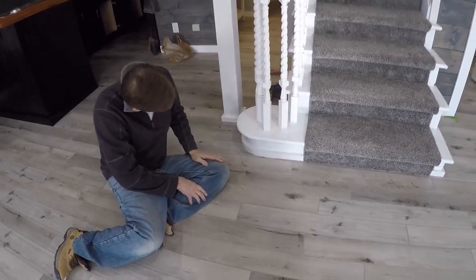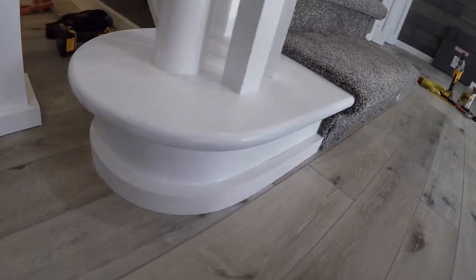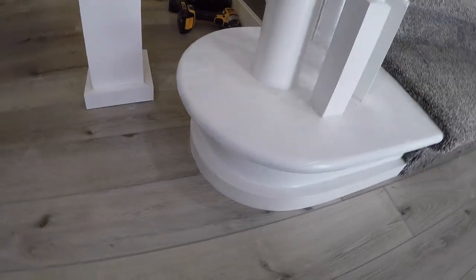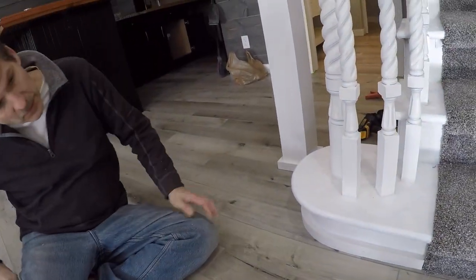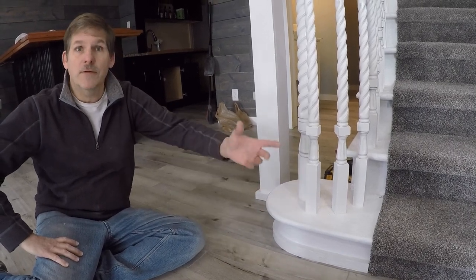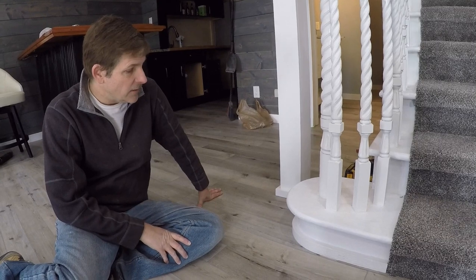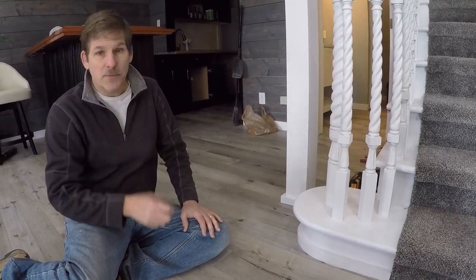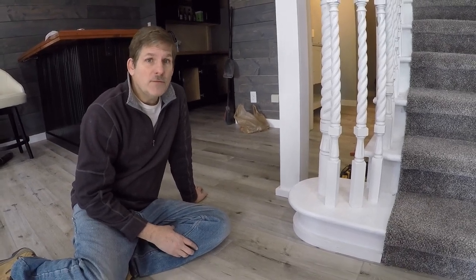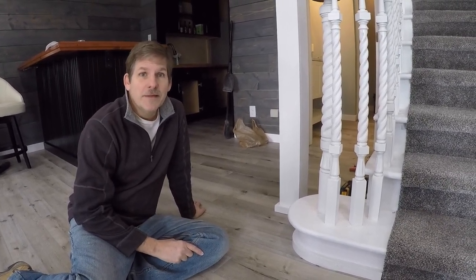We finished up the project, and as you can see, it turned out real, real nice. It just took a lot of patience in getting it bent — and using heat is the secret, but probably a more intense but slow heat, like a heat gun, would be the perfect trick. But we did good with what we had. This is a luxury vinyl plank floor, and you're supposed to have a quarter-inch gap around everything for expansion and contraction — well, that looks really ugly, that's why we did this piece of trim. Bending around the curve was clearly a little bit of a challenge, but it's actually very doable, and it dressed up the bottom of the staircase quite nicely. Thanks for watching — hope this helps as you work on your projects at home. If you have any questions, go ahead and shoot us a line and we'll answer them as soon as we can. Please subscribe — we've got lots more videos coming. Thanks for viewing, and we'll see you next time.